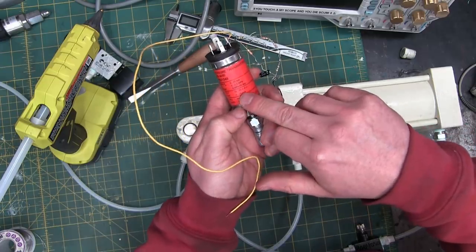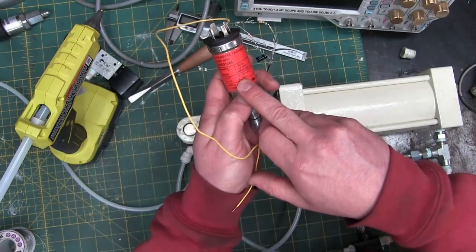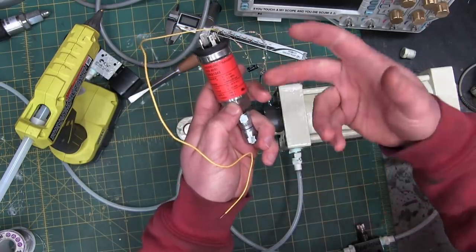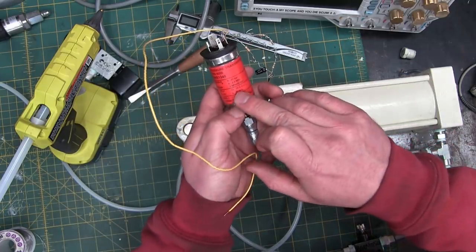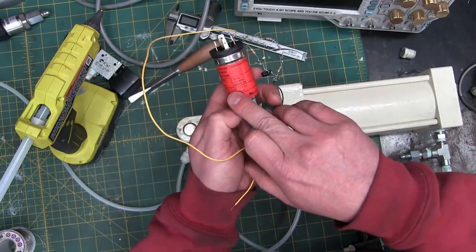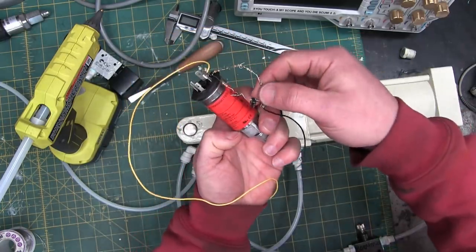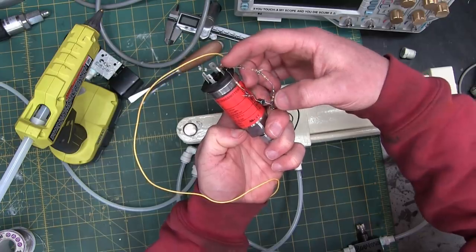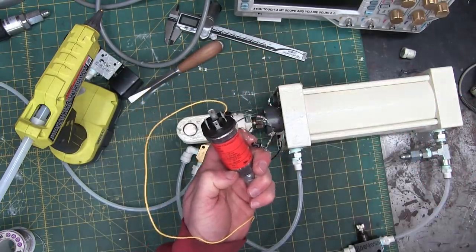Now, this is a 4 to 20 milliamp device. The 4 is the floating 0, because if it's 0, it tells you that there's a fault in the system, there's a broken wire. So that's very clever. 4 to 20 milliamps, and this will run 10 to 30 volts DC, just two lines in. We see we can have a resistor here, and I'm willing to bet this is set up for an Arduino.